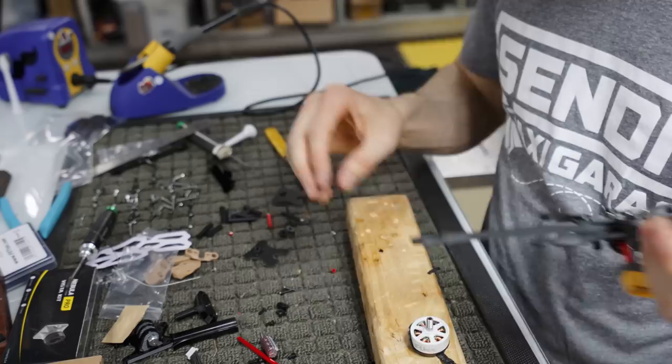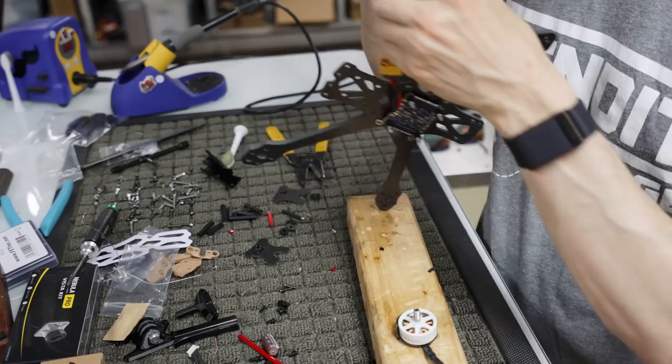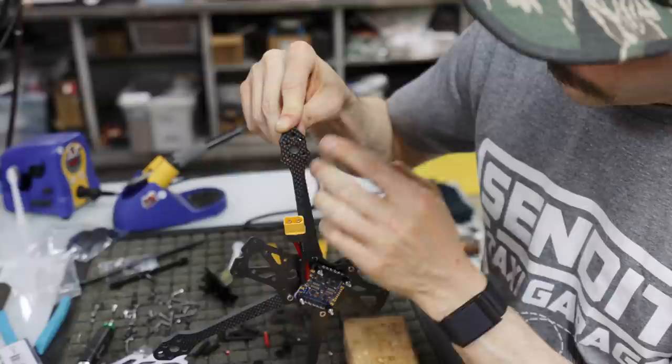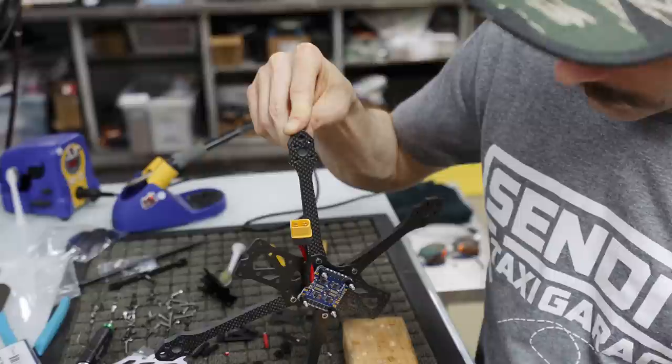And these are 16 by 16 motors, instead of the previous generation versions, which were 19 by 19. So what I'm gonna do is push the screw right here into the center hole. There's two holes here, they're all cut. There's 19 by 19 and 16 by 16, because back in the day there were 19 by 19 on this side and 16 by 16 on the other, and you can obviously put the motors on any different way. Some motors were set up one way, some motors were the other. These are all 16 by 16.